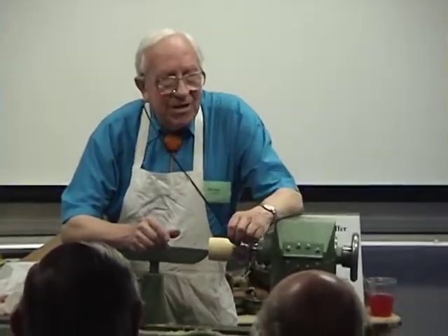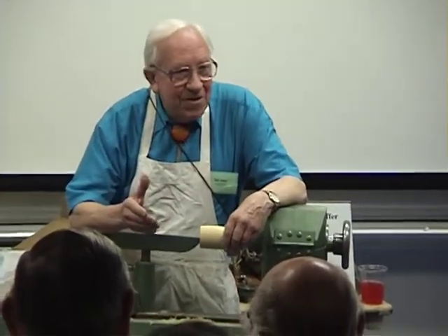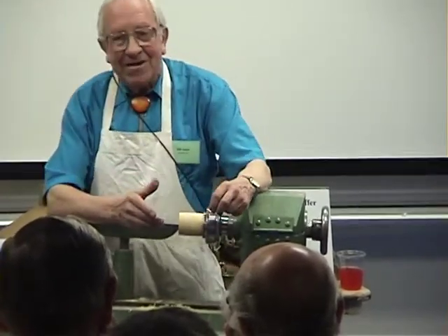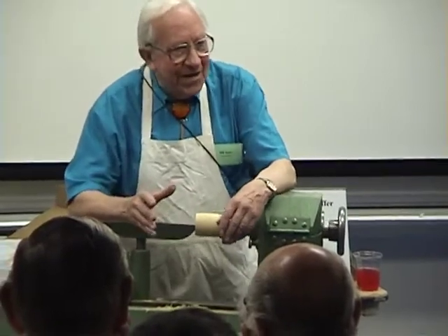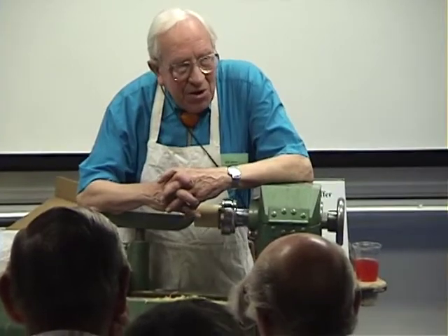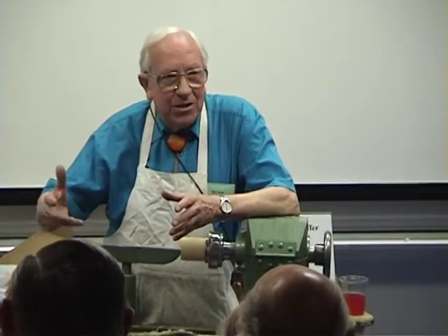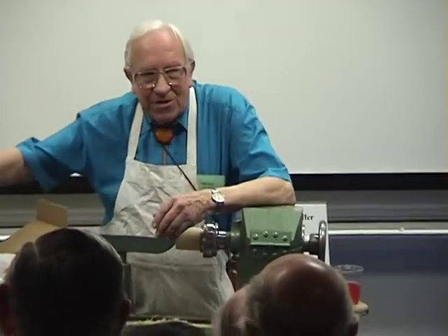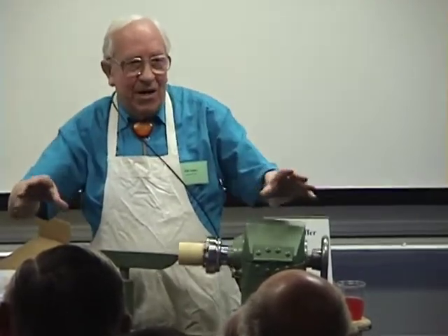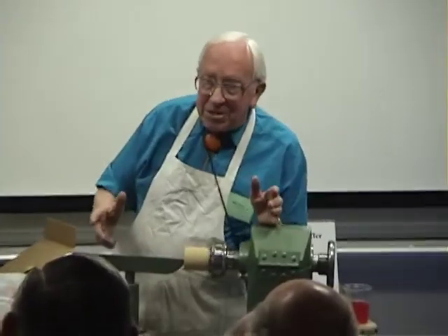The only way it can be possible is to develop the knack of striking this thread. It's a little bit difficult, and you might get it first time — or it might take several days. But it's a simple knack. You don't find everybody learns to swim at the same speed. Some might take several weeks, but as soon as you've got that first stroke, you get your confidence and away you go. The same applies to chasing a thread.